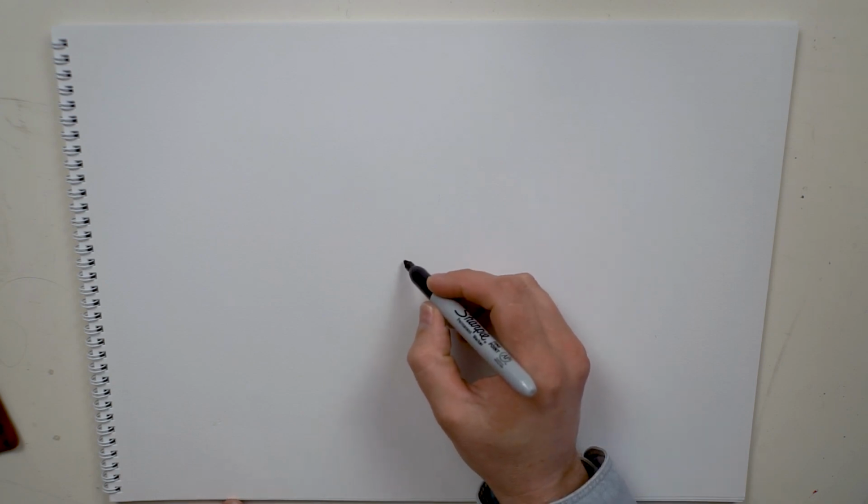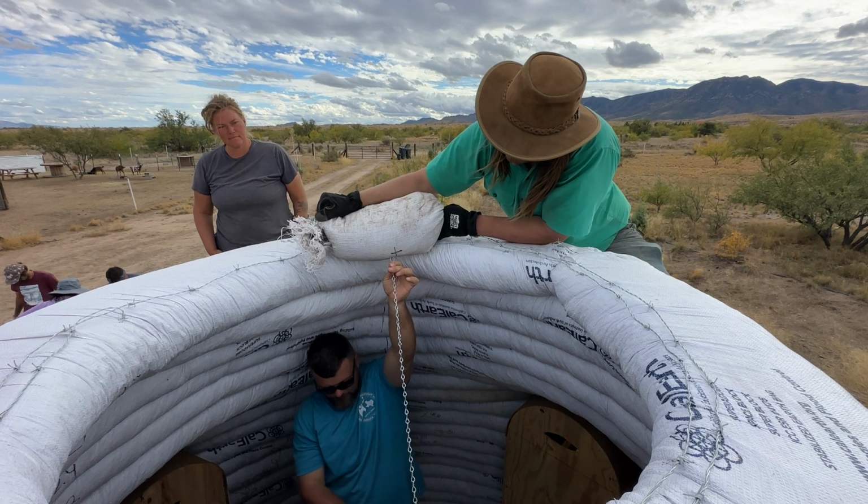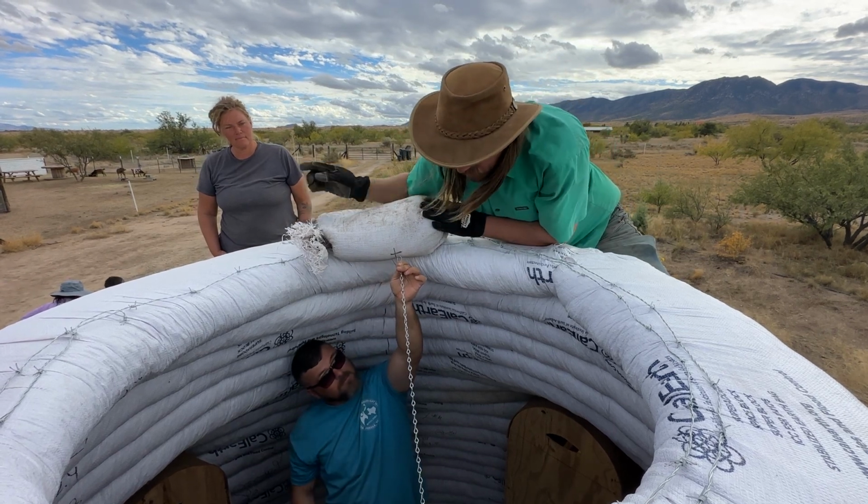We start by making a center point anywhere within the middle of the page. The main difference between the on-site center compass and our on-page pencil compass is that with the pencil compass, we're deciding the measurements in millimeters based off our imagined dome's diameter, whereas on site, our center compass is determined and adjusted every single row by mimicking the information given to us by the fixed compass, not a decided measurement taken off a tape measure every single layer. So it's good for me to start discussing this so that you can begin to understand the differences and the way the two compasses operate.